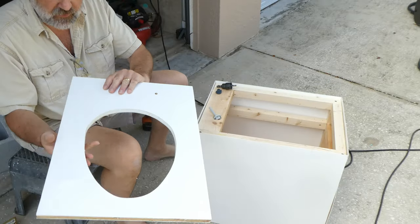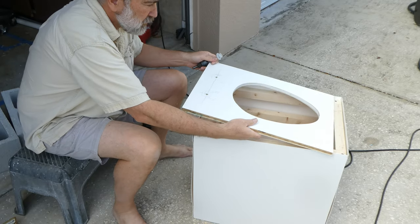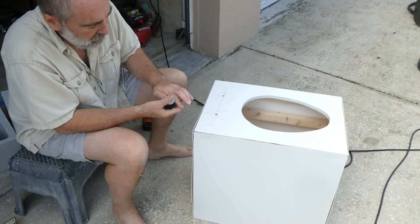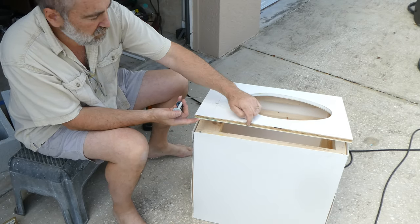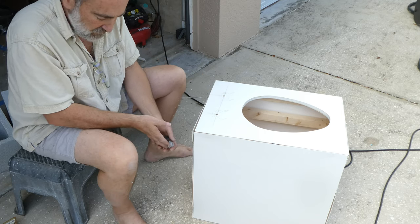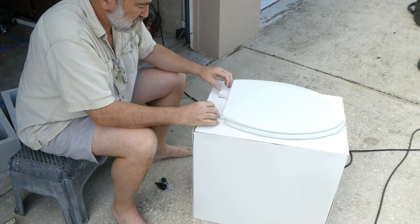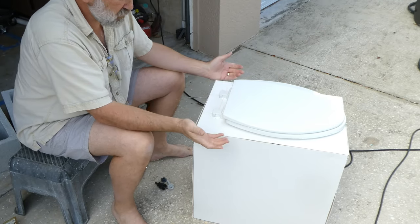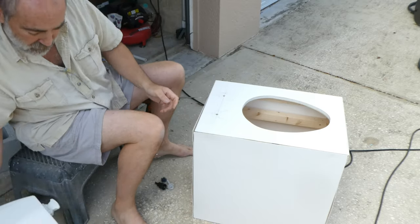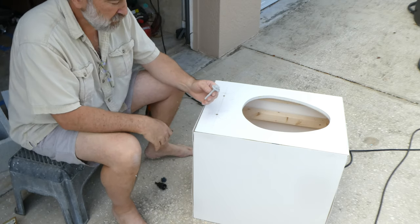I have laminated the polywall on both sides of the toilet top, and this will fit right on the top. The polywall on the sides overlaps to cover the edges. The edges will also be painted with epoxy. I have to locate where the toilet seat is going to go on top. I selected this Bemis brand toilet seat because it has quick disconnects, and its title even says Easy Clean. I located where I wanted the seat to go, and I have to drill two holes to place the seat bolts.